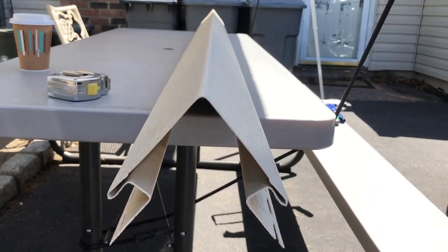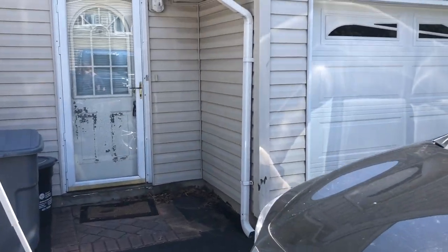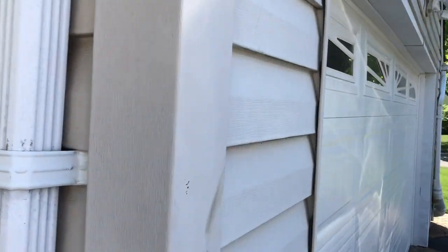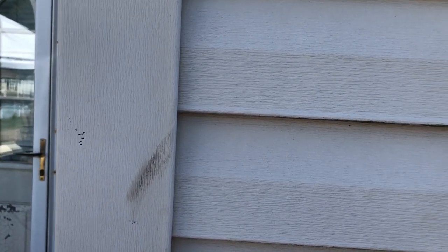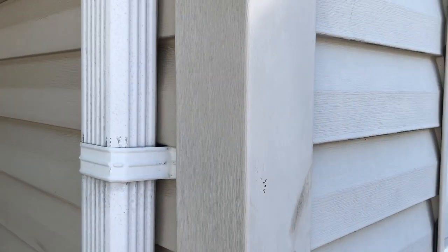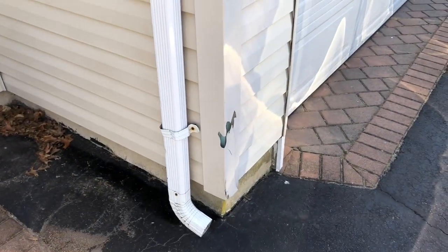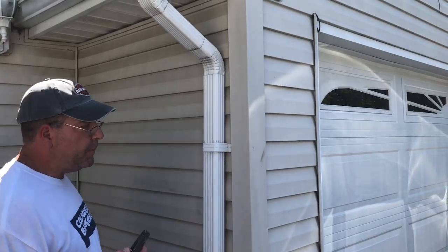Let me start by doing the demolition of the outside corner. Some people don't know how to unattach that outside corner because you're really not going to unattach it — you're going to cut it off. The existing J-channel on both sides of this vinyl siding going around the corner is pre-attached, and the inside pieces are attached later. So we're going to sidestep that because it's just too costly and time-consuming to take off the entire corner.